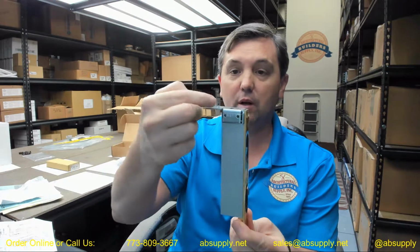The reason that it's used on wood doors is because it's conducive to mortising a wood door for a flush bolt like this that is a corner style, versus a 780, which is an extension style where you have to extend great effort to prep a wood door for a manual lever extension style bolt. They're not appropriate when compared to a 790 from only a perspective of machining the material for it. I've machined for the 780 countless times, and 780s are used for steel doors, doors that have a hollow channel, like maybe an aluminum storefront door.